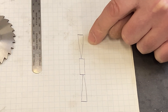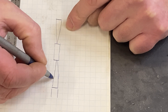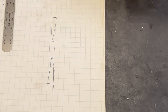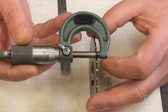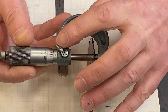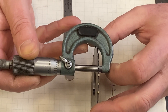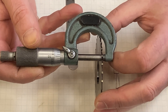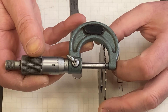In this diagram I've drawn a gross exaggeration of what these clearances look like. You can clearly see the tooth is biggest at the outside, which is super important — we only want the very cutting edge to contact the workpiece. Measuring right at the extreme outside diameter at the tip of the tooth gives one reading, but just slightly below that leading edge we're smaller. That clearance allows us to cut without generating tons of heat and friction.